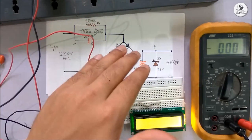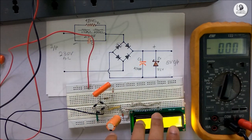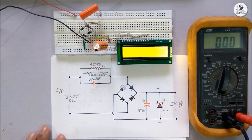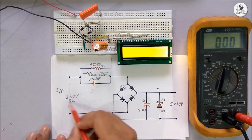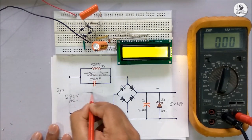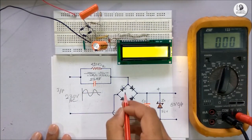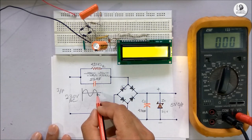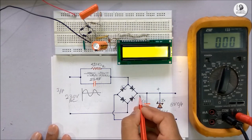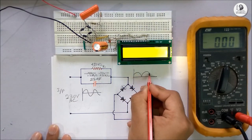With the help of this simple circuit, we can easily make a transformer-less power supply to supply small electronic gadgets. If you change the Zener diode, the output voltage also gets changed. Now, talking about the working principle: here we are feeding 230V AC at the input. Across this resistor, the waveform will be an AC waveform with a magnitude of 230V. We are converting this AC to DC with the help of this full-bridge rectifier, so after the rectifier, across these two terminals, the waveform is pulsating DC.